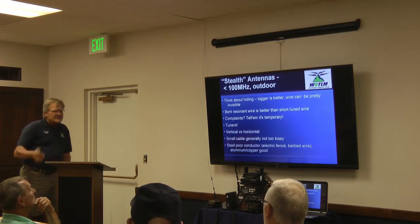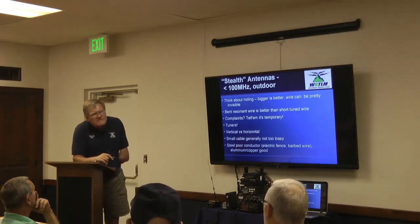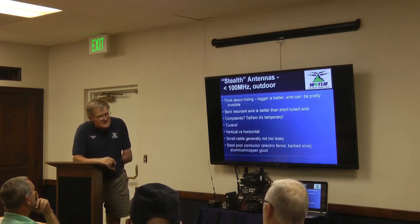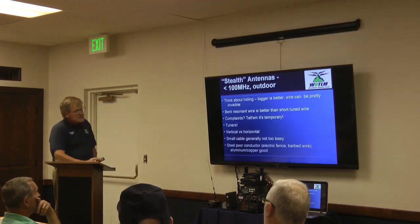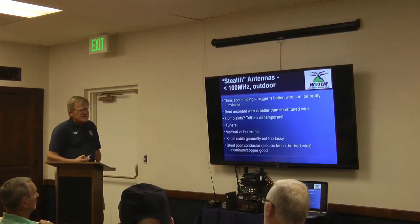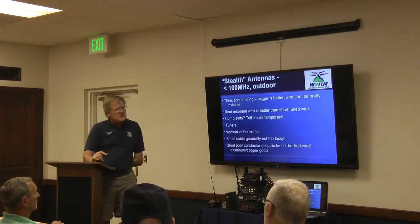It's actually, I got it at the MegaFest over here a few years ago. It's about a $500, 150 megahertz commercial Yagi for police and fire operation. And I trimmed it down to be resonant at 144 megahertz. And then it turns out it's reasonably resonant at part of 442. I think I paid $8 for it. I waited till 1 o'clock and the old guy that was selling it really didn't want to put it back in his car.